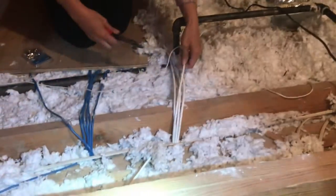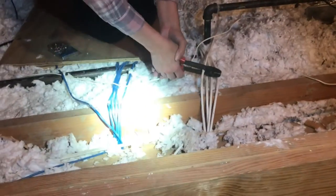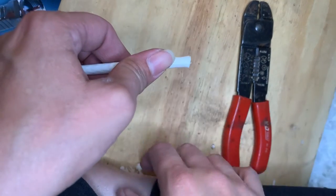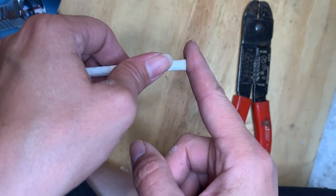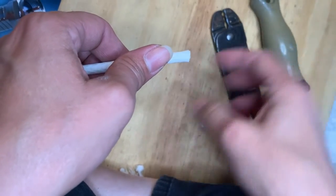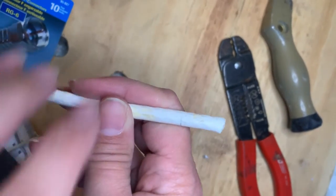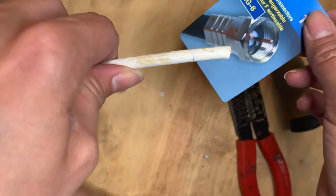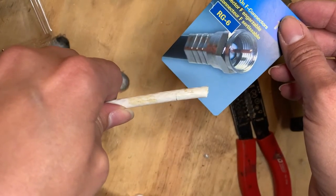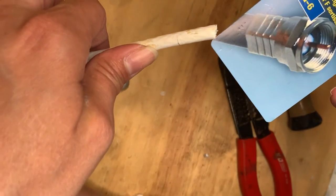So now I'm going to the point of no return with my little clippers and I'm going to cut those coaxial cables and attach them here. Make sure that wherever you cut the coaxial cable, it's long enough to reach the distributor amplifier. I'm going to give you a closeup. Basically this is the end of the coaxial cable I already cut off. These are some wire strippers, a knife, and a wrench. All of these things can be replaced by a dedicated tool, but I'm using these to make up for it — using RG-6 coaxial connectors to create a new end.